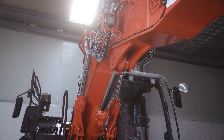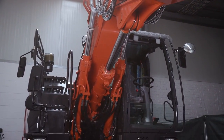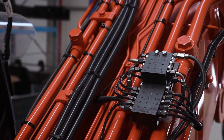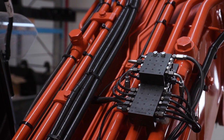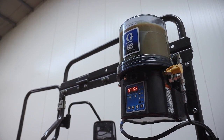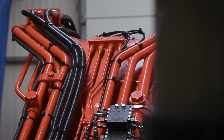Additionally, it is important to inspect all fittings and mounting hardware to verify they have been properly secured to the equipment. It is common practice to run multiple manual lubrication events to validate that there is proper grease flow through the pump, metering devices, and hoses.